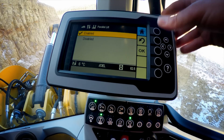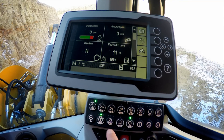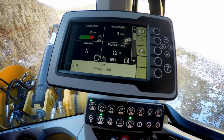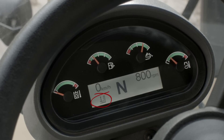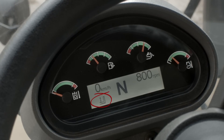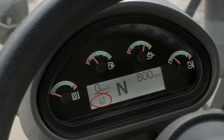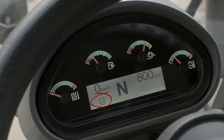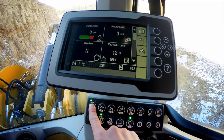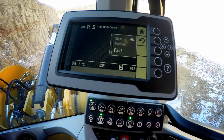Once it's enabled, when we toggle from bucket mode over to fork mode, we'll get an indication on the banner that fork mode is selected, and we will also get an indication on the primary display as an icon, letting us know that perfect parallelism is going to automatically correct to maintain true horizontal all the way through the working range. A simple push and hold when in fork mode will bring up the ability to adjust the modulation or the speed of the hydraulics for both lift and tilt.